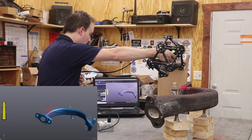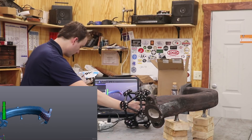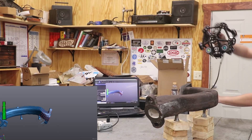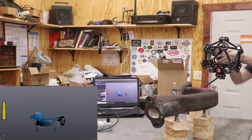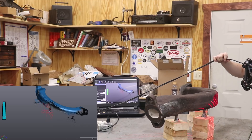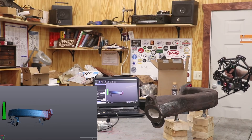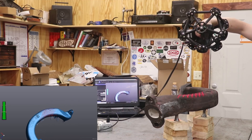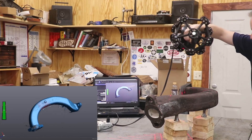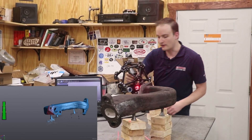Since it's being tracked by the camera system, something that is actually pretty cool — since I've kind of reached the end of what I can scan from this area, I can set the scanner down, move around, come to the other side, and start right back up. It knows exactly where it is and where to pick up. I'm already probably 80% done with this scan. What this essentially is, is just a really fancy tape measure. It's taking about 100,000 measurements a second. They're highly accurate and it allows you to really capture details in what you're scanning. I'm even picking up the surface finish, numbering and all of that. It makes it really nice and very usable downstream.